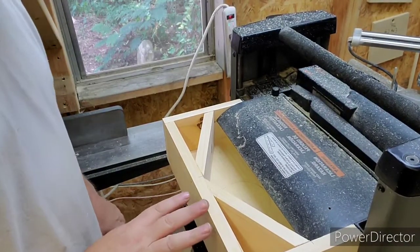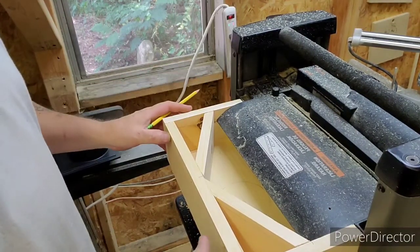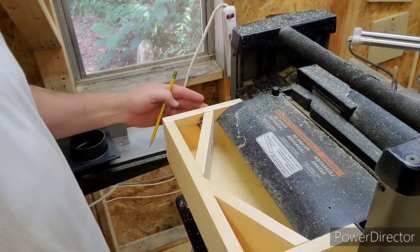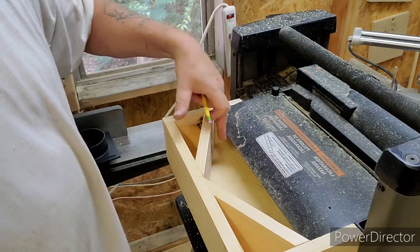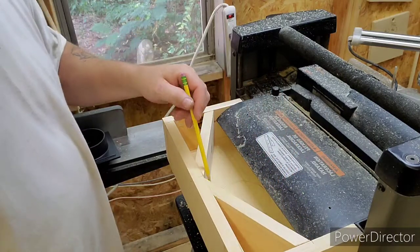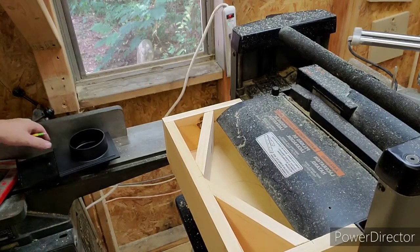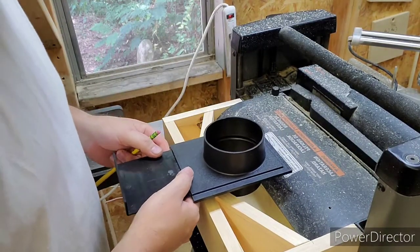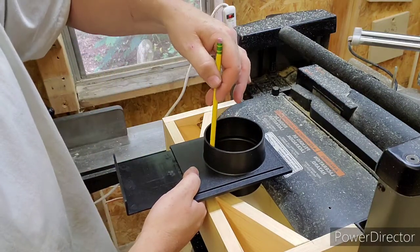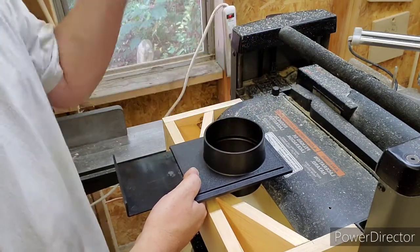Here's the concept — this is what I've gotten done so far. I've built the box pretty much like the one I had. It butts up here, and on the bottom it's flat up against the machine as well, so it's completely sealed off. The chips come flying out of here, and I've put these angled pieces of wood in here so that everything is being thrown to that center right there, where I'm going to have the blast gate mounted to the top of the box — everything that comes in is thrown to the center where this four-inch blast gate will pick it up.